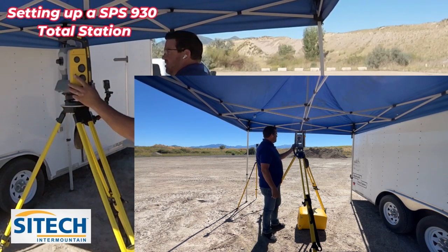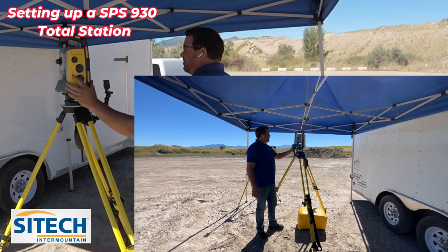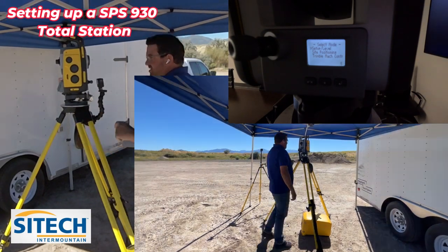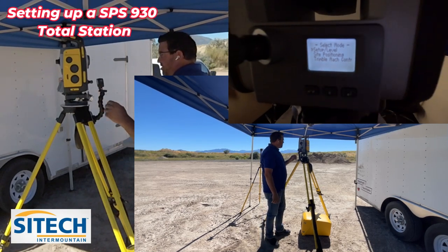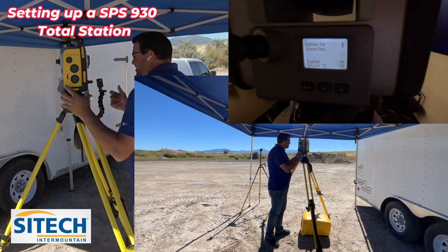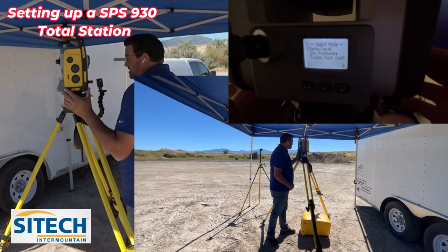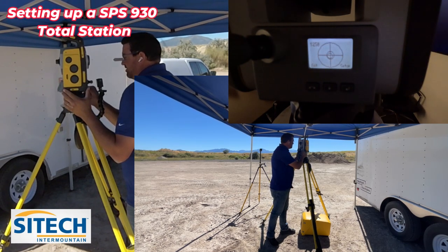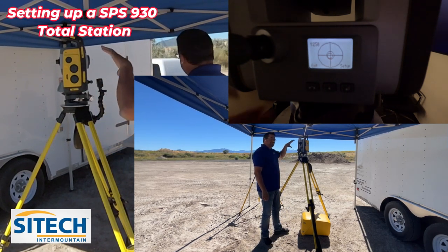On the side right here you've got a power button. All you've got to do is click that once and it's going to bring up a menu on the screen. It's going to say starting. Once it's turned on, it'll do a quick count from one to ten in the bottom corner to allow you to go to setup or the other settings. If you missed that and it just comes right to the main screen, no problem — just tap the button on the side and you can see where setup and level comes in under site positioning. The little enter button in the bottom right here, that arrow, is the enter button saying you want to start with leveling the bubble inside the total station.